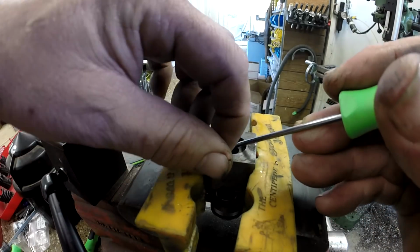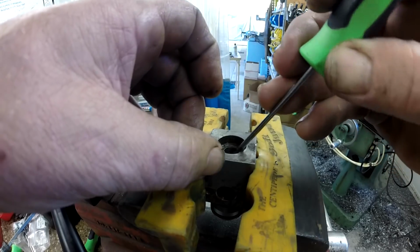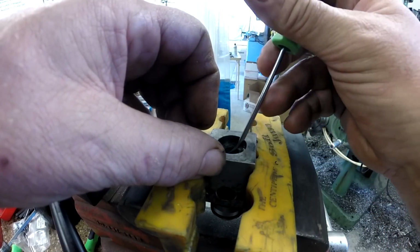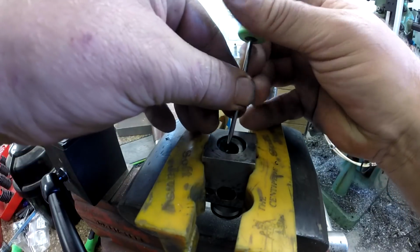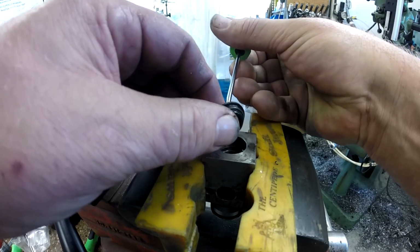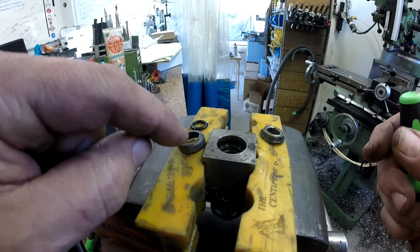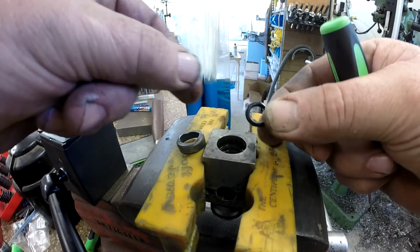All right. Oh, they got like a spacer here. Okay. That's what's pinching down on that rod seal. Let me see if I can dig that seal out of there. The rod seal is just an O-ring. Get this hook behind it. Oh, I got the seal and the spacer all in one. Look at me go. Okay, so that's the actual rod seal. What I dug out of there, that's more like a dust seal. So that's the little fella right there.